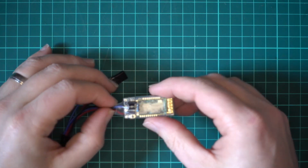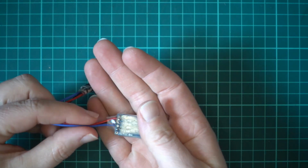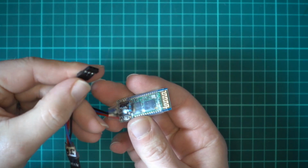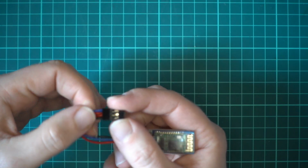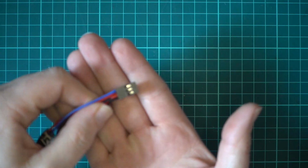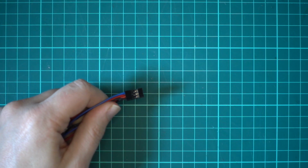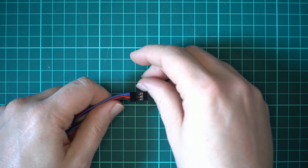What I've done with this one is this is a standard Bluetooth module, which I'll get a link to in the description. I have this cable here, which will plug into the back of an R9 unit, which uses the standard sort of SmartPort wiring layout. There we go. You can see the middle pin is power and the outer pins are ground and signal. So that's like a normal servo on anything else.